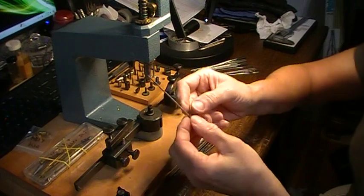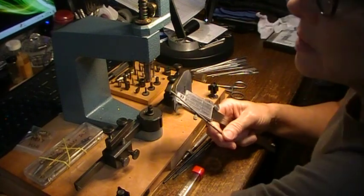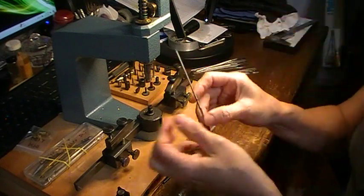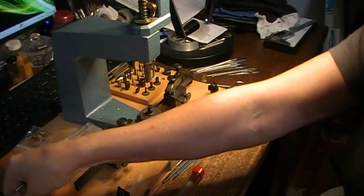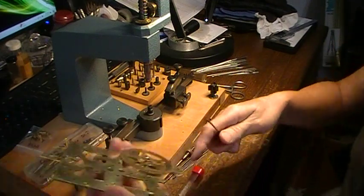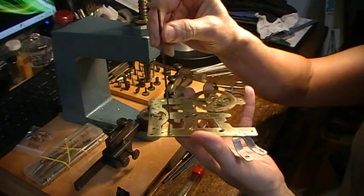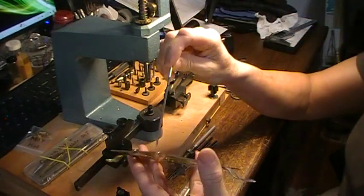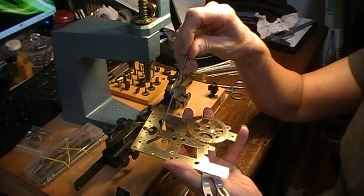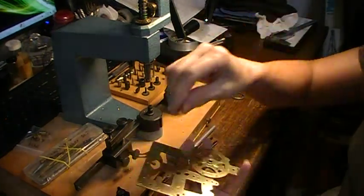You mark on it to measure with your calipers. Measure the end of a wheel, measure with your calipers, make a mark or put a piece of tape. And then from the inside, you broach out the hole. You try to keep it straight — there are little holders and handles for these. You try to keep it perpendicular. It's real easy to make mistakes, get off at an angle a little bit. You have some pressure on your wheel when you test it and put it in there.